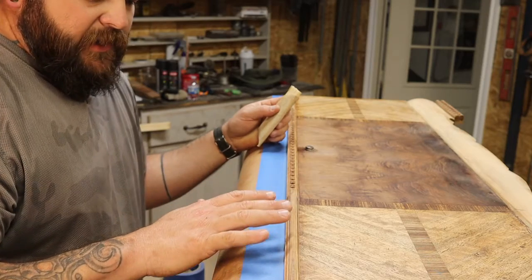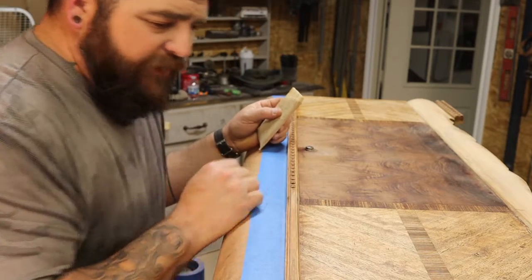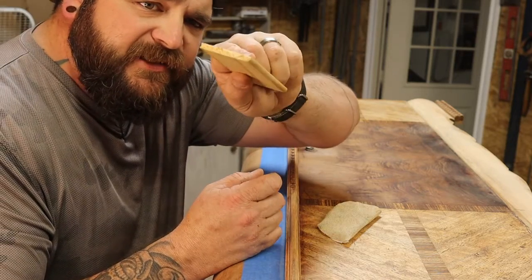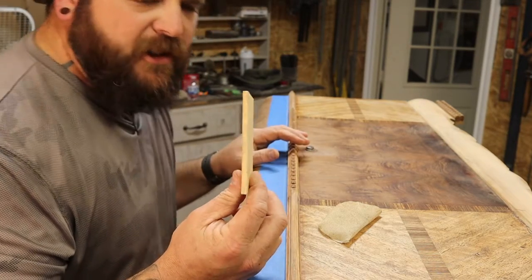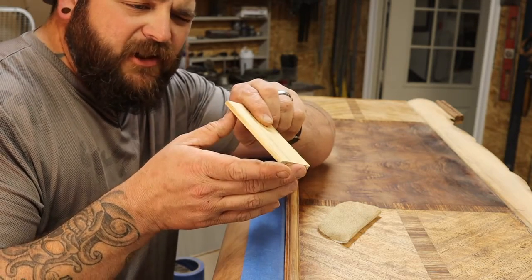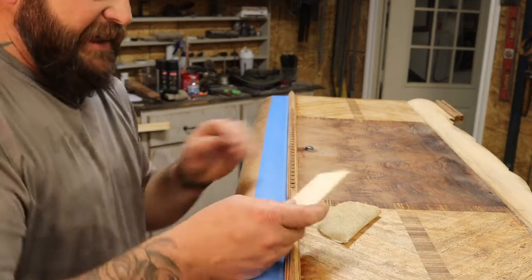I've made a little bit of progress and figured out the best way to get down into the little crevices on this molding. I have some 150-grit sandpaper and a thin ripping off of a two-by-four. On store-bought lumber the corners are kind of rounded over — this one almost has a perfect round-over, like you went down it with a router bit. I initially was using this as a sanding block, and then I realized this rounded-over edge fits perfectly in the tiny little cove.